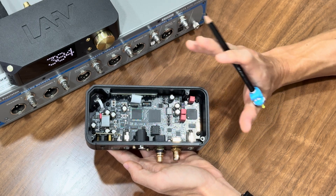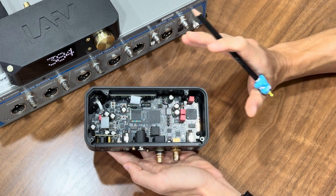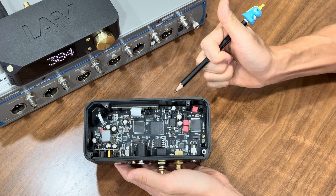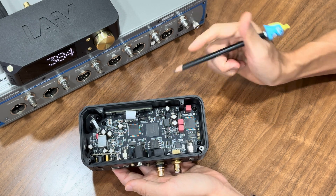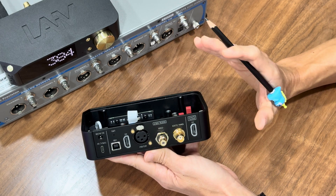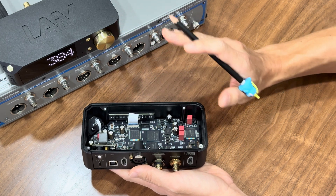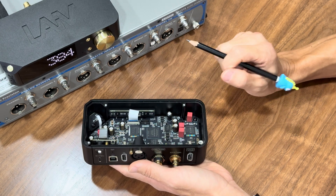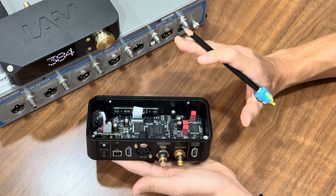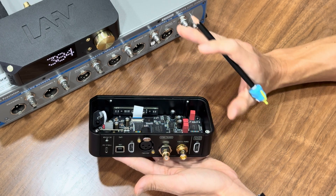One thing interesting is that the clock signal of the Micro DDC — be it the built-in femtoclock or the external master clock — is also processed through this timing-critical CPLD. The processed clock signals are routed through the galvanic isolator and fed into the FPGA for signal processing. It is quite a complex process altogether, but with one goal in mind: ensuring impeccable digital audio performance. With the Micro DDC, you get ultra-low jitter clocking for better timing accuracy, multiple digital inputs including I²S, and seamless integration with high-end DACs to unlock their full potential.